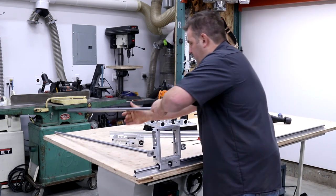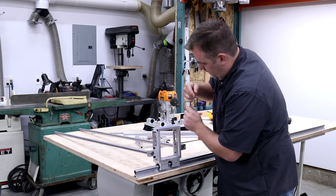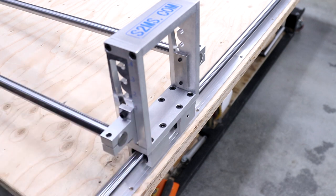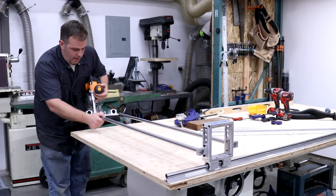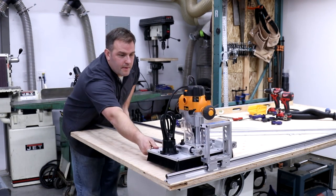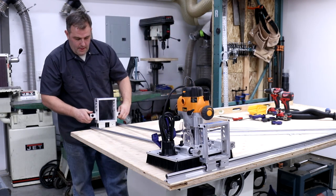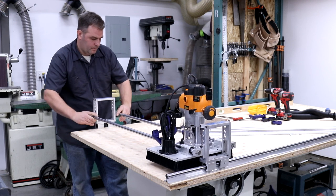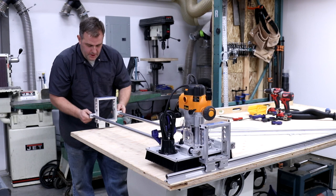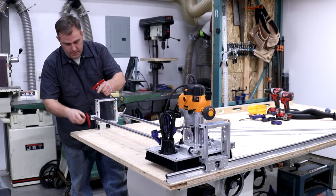Make sure it's nice and firm. Go over to the other side — you want to make sure that your brackets are flush with the back here so that the two brackets will be parallel. Now that we have that side on and square, we'll put this on once again very gently — we don't want to knock the ball bearings out. We'll slide it on. I'll use a couple of bar clamps to clamp it from sliding towards me. Then I'll take the other end and slide it on, once again making sure that the brackets are flush to the back of the groove. I just want to pay attention to where I want my rail — so about there is good; it's flush, it's square. I'll grab the handle and the wrench and tighten it on.